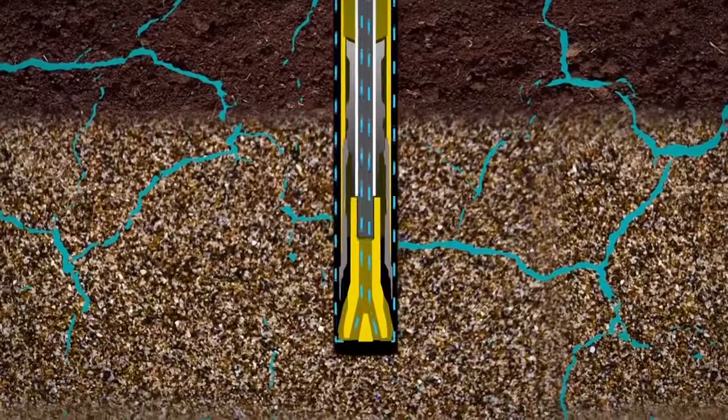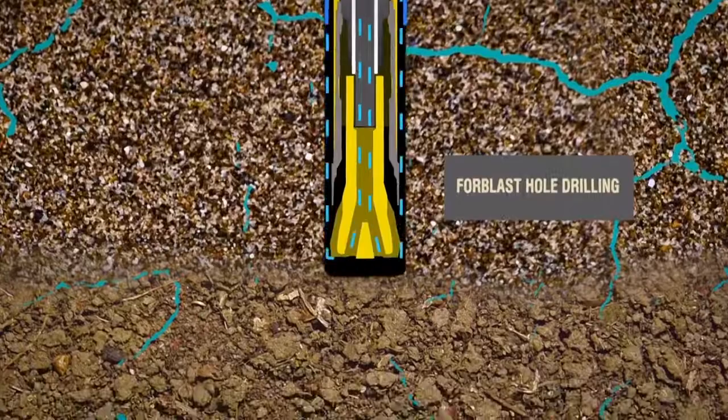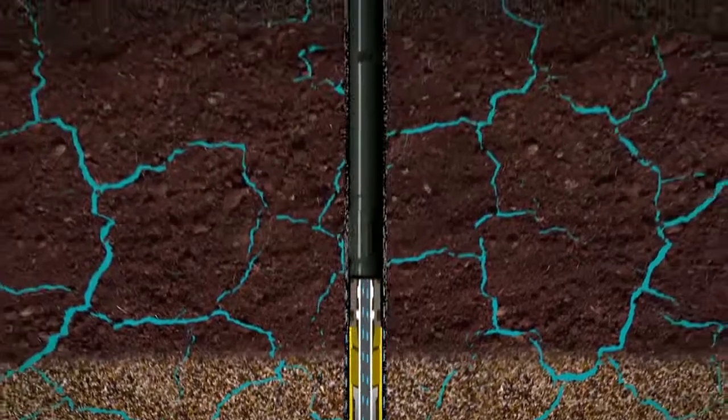For comparison, during the drilling method with direct blowing, which is mainly used for blast hole drilling, cuttings reach the earth surface using the same air pressure, but through the annulus, where the sample is naturally contaminated.